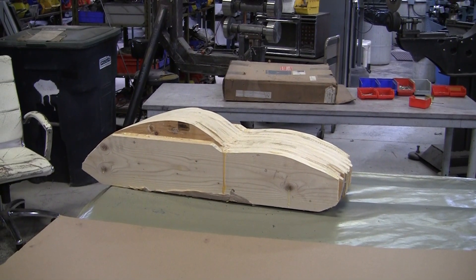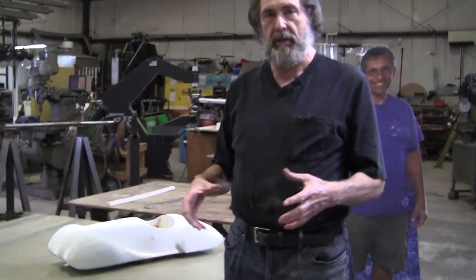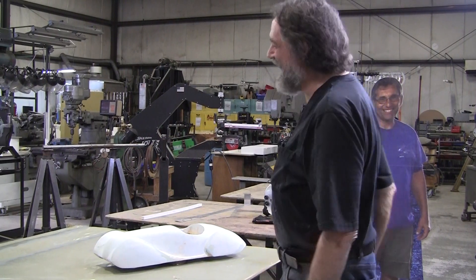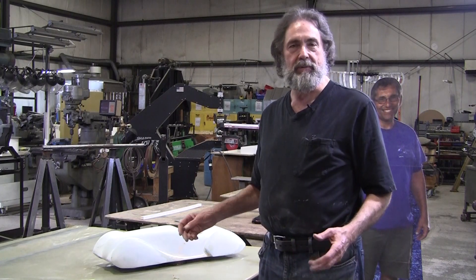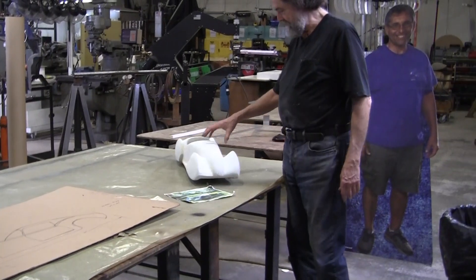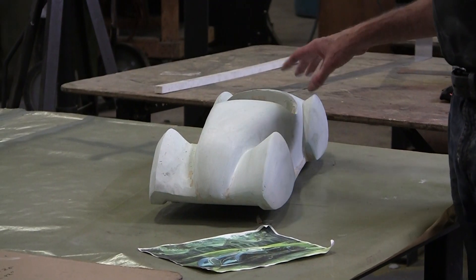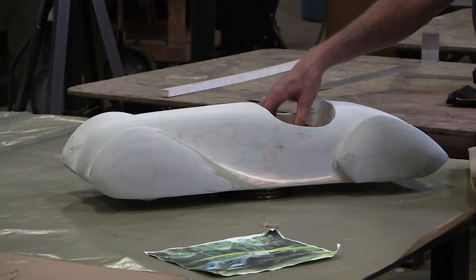That's a pine that I got from a wooden box from a big architectural job, and the brass stalk — it was tubing — was in the box. We had like two or three boxes with really nice pine boards. So we got these nice pine boards, and I've got a wood planer, planed them, glued them up like this one. There was a center core that we glued up, and I had to account for this, so these had a little bit of a relief in them. I couldn't sculpt it exactly the way I wanted it, but it saved a lot of grinding. Once I had the pine and accounted for the cockpit area here, I've got a potential for making a really nice model.